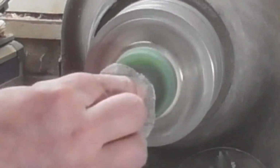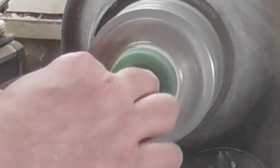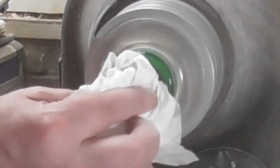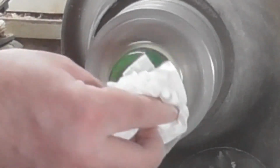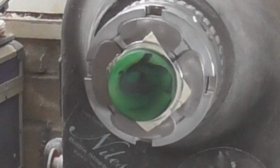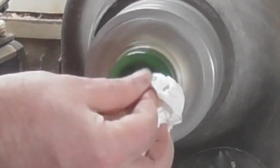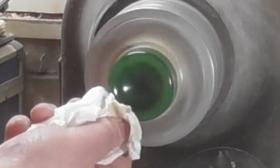Alright, just sanding to 400 grit here with Klingspor abrasives. A quick wipe down with some methylated spirits or denatured alcohol. Some Yorkshire grit abrasive paste. This is the original. Just wipe this on until you have a clean paper towel and you have the equivalent of around about 1,000 grit.